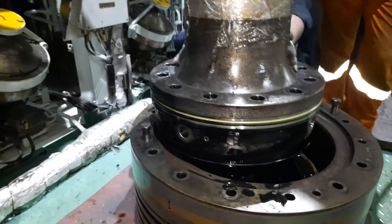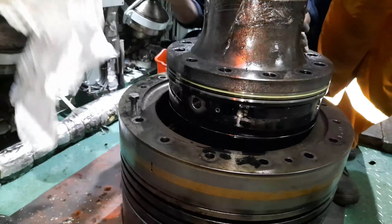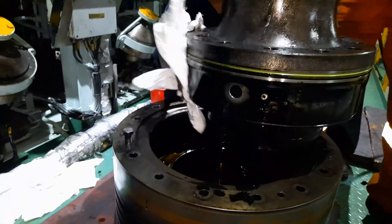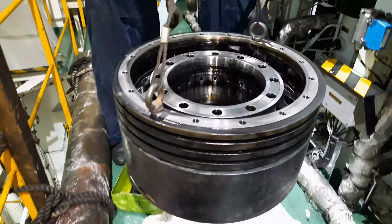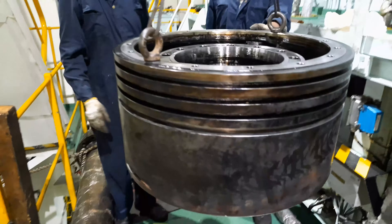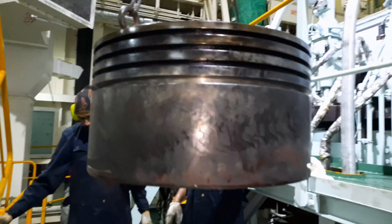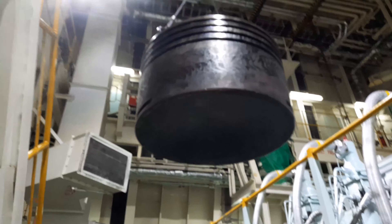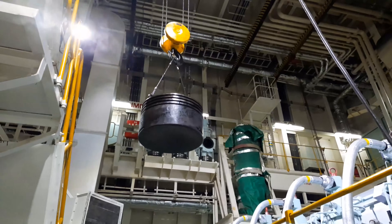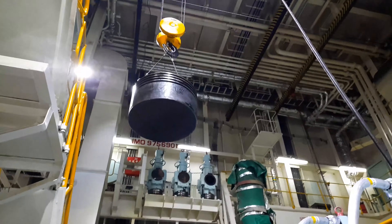This is one of the major reasons for breakage of the top ring, and the only solution for this problem is to dismantle the piston crown and send it to shore for reconditioning. In this video, I want to stick to the main topic of decarbonization. I will be coming up with a separate video detailing complete procedures to dismantle the piston crown and skirt from the piston rod, so do stay connected with my channel by subscribing it now.